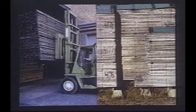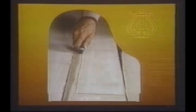On arrival in our yard, the lumber is stacked into packages. Sticks across each layer allow for proper circulation of air in the drying process. The lumber is air-dried for up to 1 year and then kiln-dried down to about 4% moisture content to remove any tendencies for warping and cracking. The dried lumber is selected and marked for cutting.